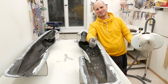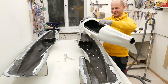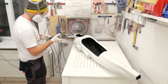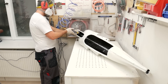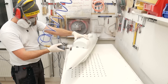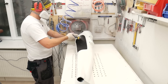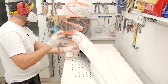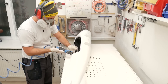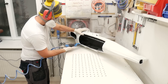The fuselage was preheated overnight and afterwards heated in the oven at about 50 degrees for 8 hours. Here it is — the first Harrier fuselage! Super lightweight, super nice. After molding, it goes through the trim process using air power tools.